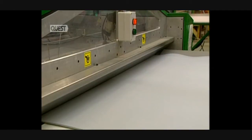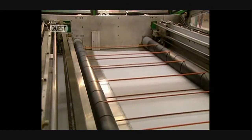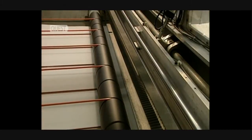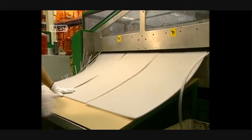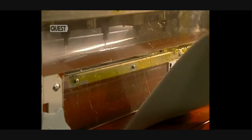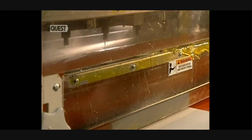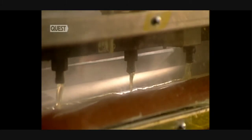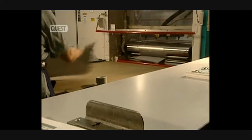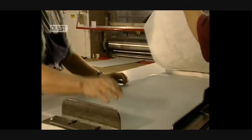Next up is the foam support of the puzzle. This guillotine is used to cut the polythene sheets onto which they will glue the cut images. Foam sheets are inserted into this laminator and heated to 232 degrees centigrade. The sheet with the design on it is glued onto the foam with a thermosetting adhesive.